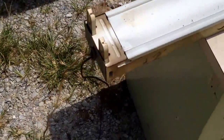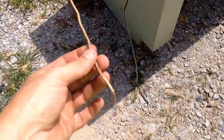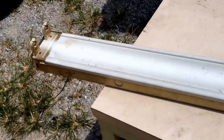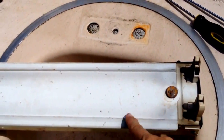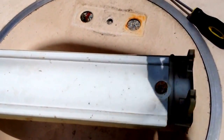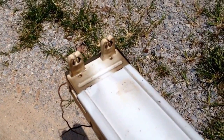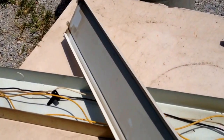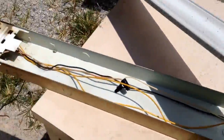These ballasts have some pretty nice copper wire on them. It depends on how you pick them up — how much is going to be hanging on the end — but there will be some on the inside. The first thing you want to do is find the mechanism that holds the bottom panel on. Turn it, and some screws can turn by hand. Pull this end up and it'll slide out. Take that piece off. You want to test it with your magnet — I know this is steel because it has rust on it — so we'll set that off to the side.